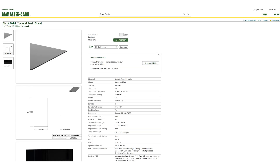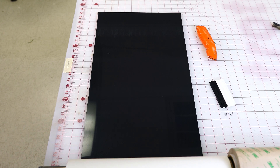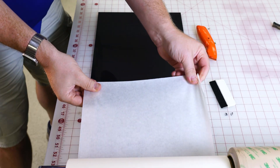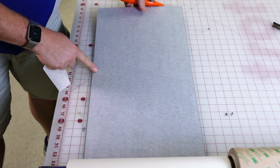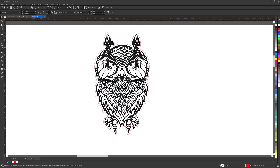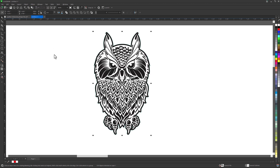Now to create the laser process leather embossing die. After testing I found that the most durable and best material for this process is acetal resin, also known as Delrin plastic. To create the leather die, first place a paper mask onto the top surface to protect the Delrin plastic from the laser's heat, using a squeegee to remove any excess air bubbles. To create an embossing die graphic, start with a black and white graphic like this owl image with a white background. Select and invert the image so that the white turns black and the black turns white.